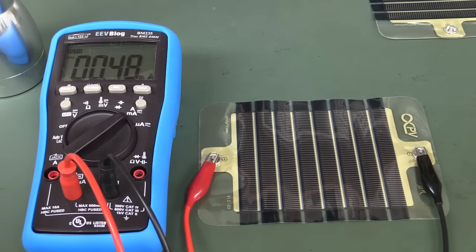So you'd have to go through the whole life cycle analysis of how much overall energy is required to produce a regular rooftop panel, for example, a polycrystalline panel or whatever, compared to an equivalent output of a printed one like this. And do the whole life cycle, which is a complex thing. That's manufacturing the raw materials, mining them and transporting them and processing them and then transporting them again. And then the manufacturing process of the panel itself and then testing and shipping and everything else. So life cycle analysis is quite complex.